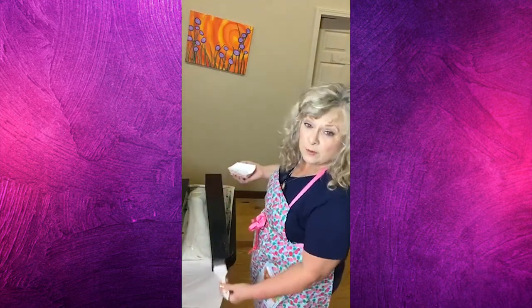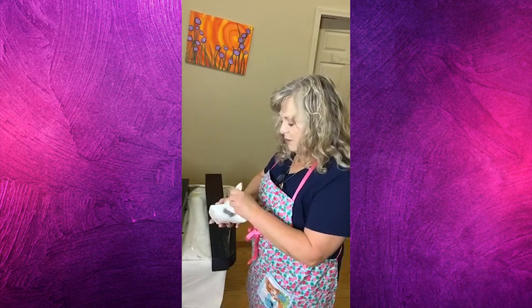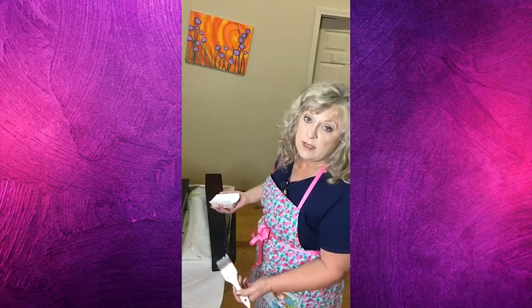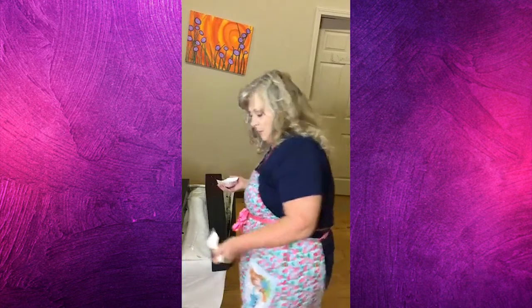Like I said, you wouldn't ordinarily think of needing to do the foot underneath this, but with this paint, if it doesn't have a finish that's going to harden on there, it's going to need something, or the water on the floor when somebody has a spill or your doggy does something he shouldn't, it's going to reactivate that black paint. And nobody's going to understand why they have a black puddle on the floor.